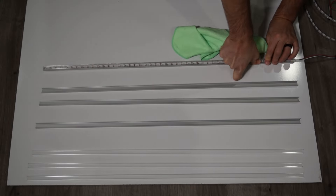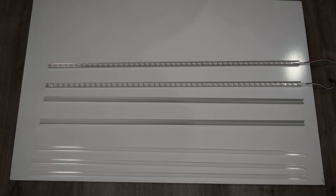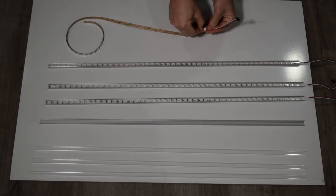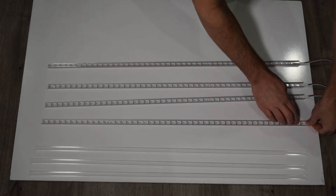The non-connector end of the LED strip should be about an eighth of an inch from the end of the channeling. Gently press down on the LED strip to make sure the adhesive takes hold, then grab the channel covering and clip it into place starting at one end and working towards the other.